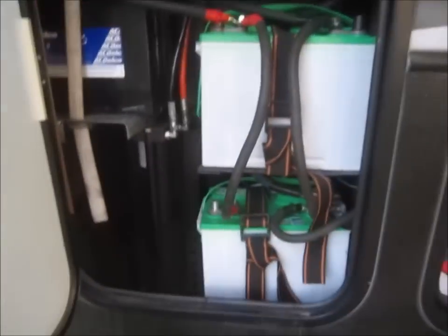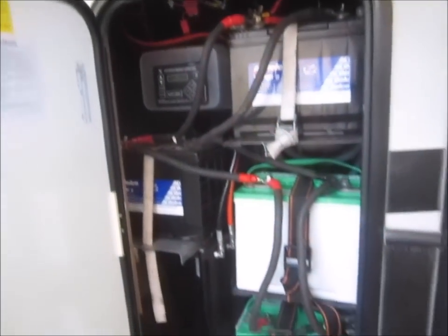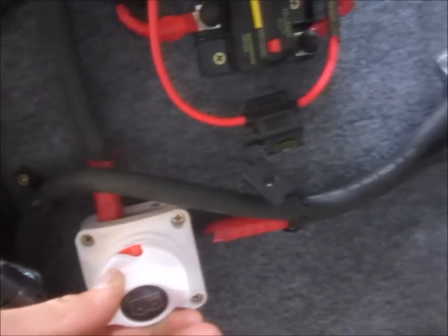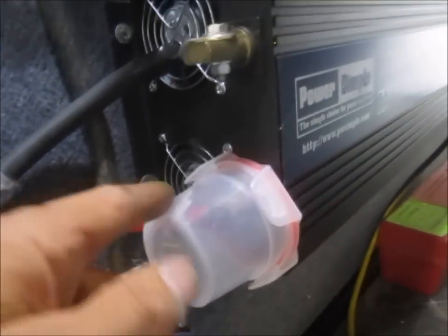For this season I have four group 24 marine batteries, hooked up with a double cable. It comes through the wall into a 250-amp fuse on the power-to-battery disconnect, and goes back into the inverter.